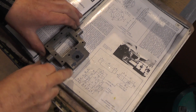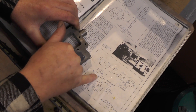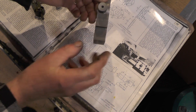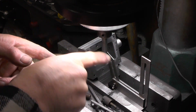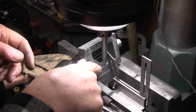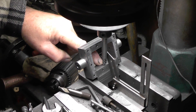Let's have a look at this next part of the steam chest. Everything's done now except for joining the steam hole up from this point here — I've drilled in so far down at 5/16th diameter and now I've got to put this in the milling machine and drill down at this angle to hit that hole there. I've got the steam chest set up in the vise on the mill. The angle is not super critical — it's 20 degrees from the vertical, or 70 degrees from horizontal. I've got to spot face this angular face just to get it horizontal so my drill doesn't run off.